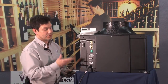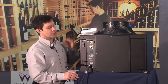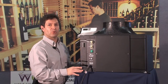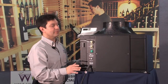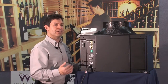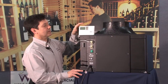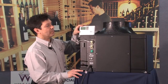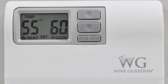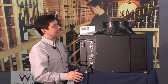It's now time to plug in the fan coil section to the appropriate power and turn the on/off switch on. As with all Wine Guardian systems, there is approximately a five-minute time delay between when you turn power on and when the compressor starts delivering cold air to the wine cellar. This five-minute time delay is adjustable but is there to protect the compressor from short cycling — you don't want the compressor turning on and off rapidly. After the delay, the controller will illuminate and you may see a high temperature alarm — don't be alarmed.